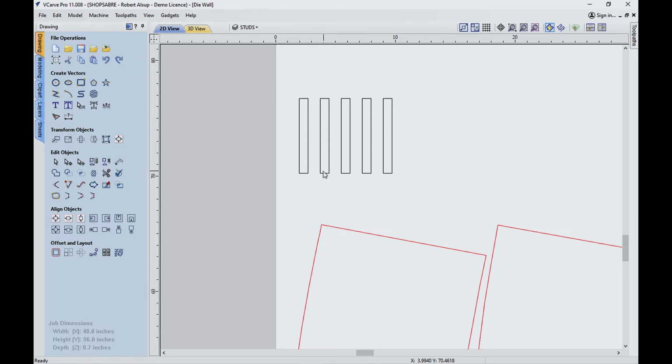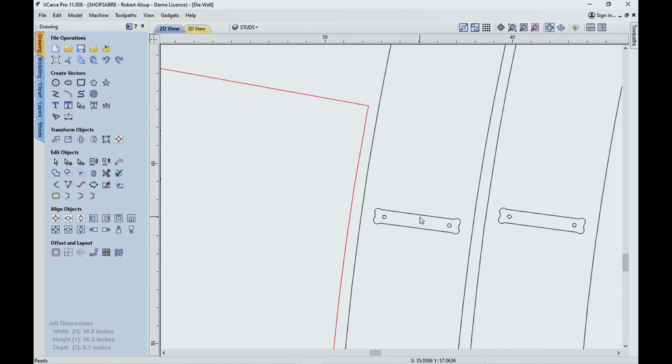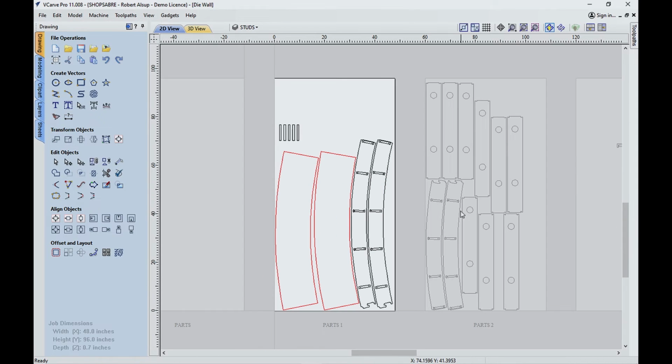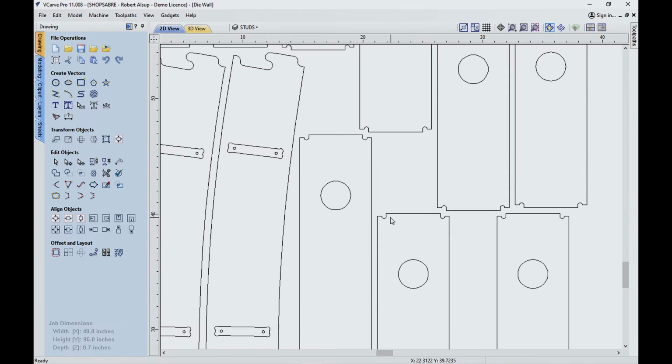And so what you do is you make a cut with a certain offset, and then you can take a piece and test it, make sure it's the right size. Then once you know what that offset becomes, you can actually offset the tool paths that are used for this, and it'll give you a nice fit. But making this little operation to start with helps you determine what the correct offset's going to be. And then if we look at the other nest, just more of the same, different parts, but the concept is identical. Now, let's look at the tool pathing.